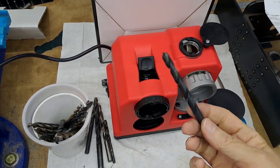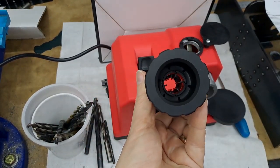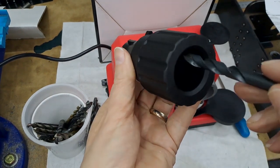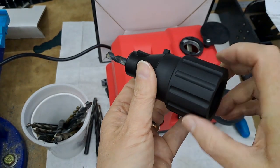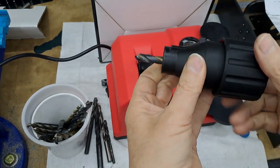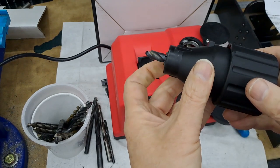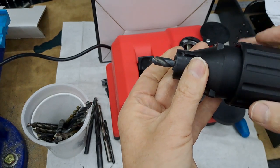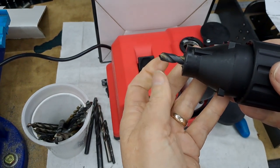Back again — one drill out of the pot, one holder. I've opened it up quite a bit — you can see from the last shot those six fins in there are a lot wider now. Drill goes down the middle, sticks out a bit — wind this down until it just starts to hold. Now you can just start to see those fins coming out — that's maybe a little bit tight. There we go — so that's kind of just at the point where it's going to start clamping.